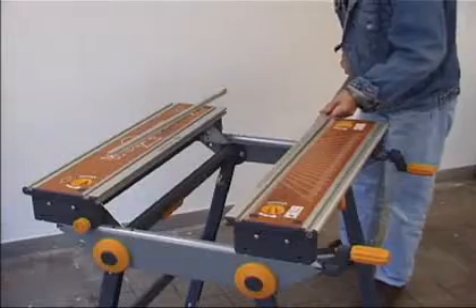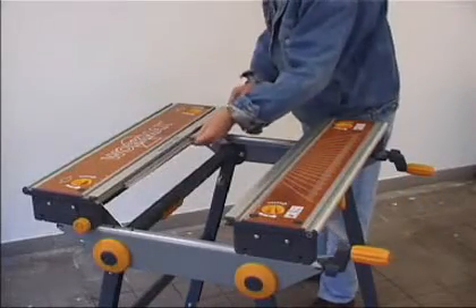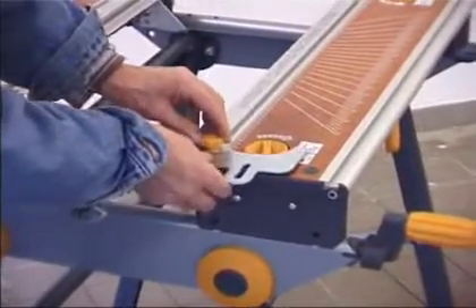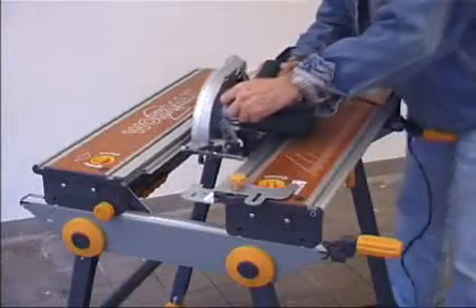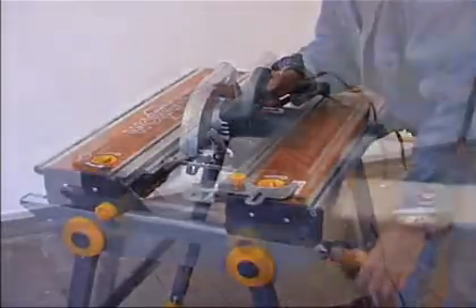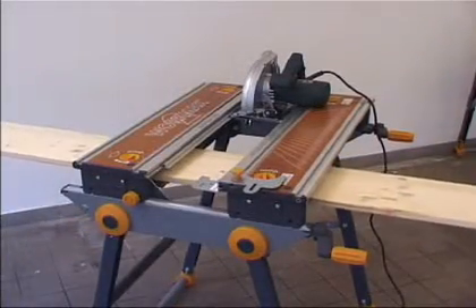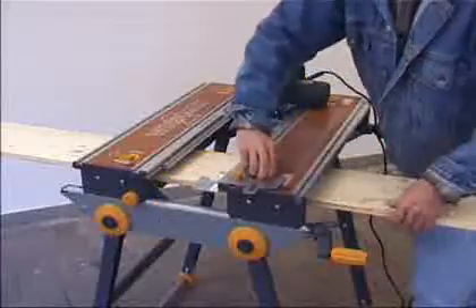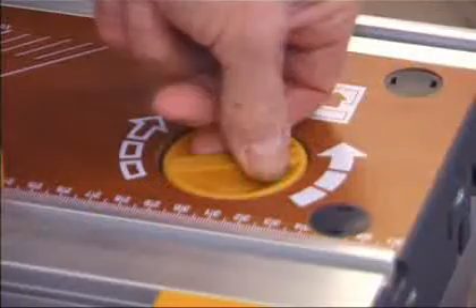So how do you make a clamping table into a machining table? Zoom provided the solution. You add tool supports to the jaws and a machine end plate, and you adjust the jaws to the width of the power tool, testing that it slides precisely and freely. You then utilise the up clamp to hold a workpiece to the underside of the jaws, first making sure that it is aligned square to the jaw and is set at the correct point for the cutting line, then tighten it into position with the up clamps.